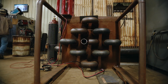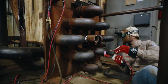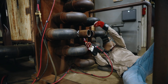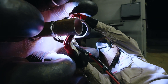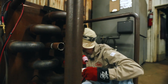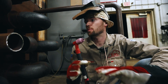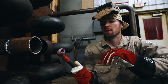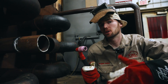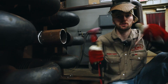I'm going to go ahead and crank this thing down. Now I got some wire and I'm going to fire in here on the bottom again. We're going to go up as far as we can, moving along nice and slow. We got that bottom quarter done. It's pretty tricky sometimes to weld in these positions — you're going to stick your tungsten a lot and mess up a ton. That's why it's really important to always be challenging yourself and not always taking the easy way out. Let's sharpen our tungsten because I stuck it, and work on this other quarter.